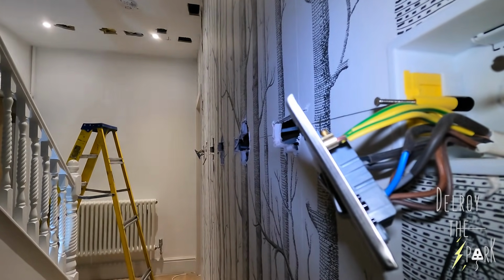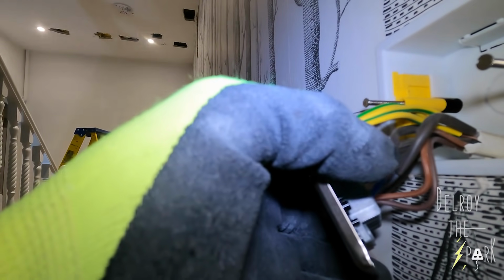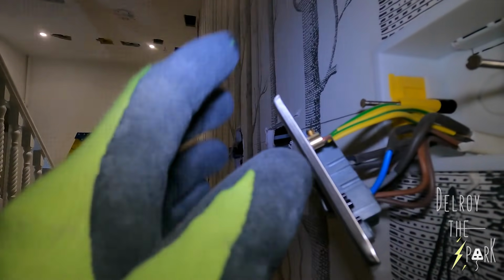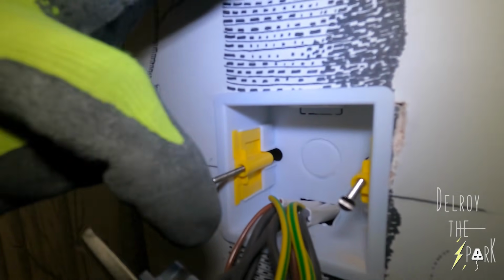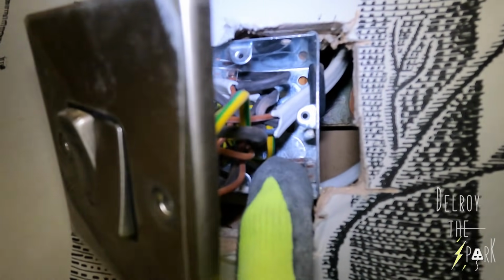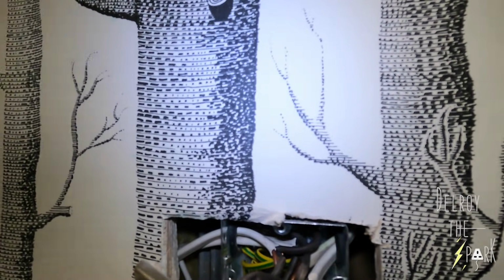The switch line and the feed from the light, one goes with the brown. I put the brown with the brown and the blue, some sleeving over it, and put it with the grey, okay? So the switch line and your feed go with the 2 strappers. And I've used the black as the common, so that's in common here, it's in common upstairs. And here, you do a joint, if you can see those Wagos, you join the 2 blacks, so it passes through here and goes up to the top switch in common, okay?